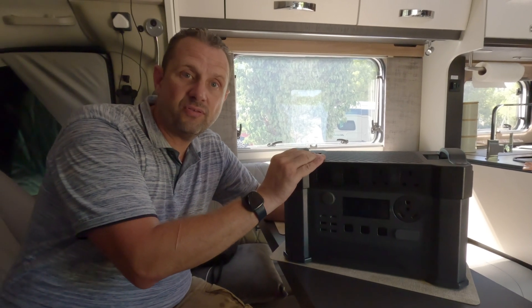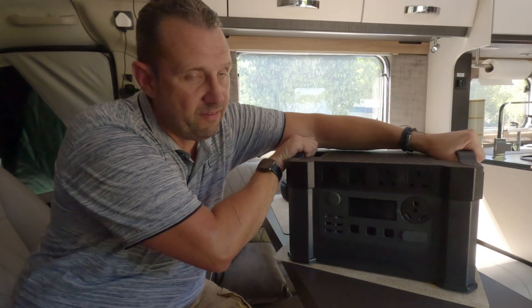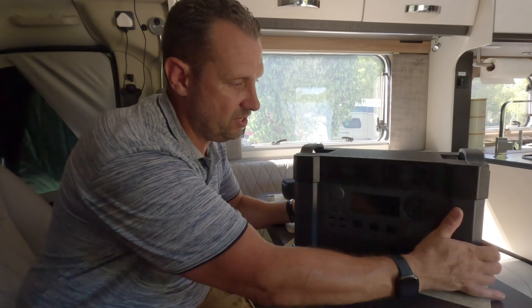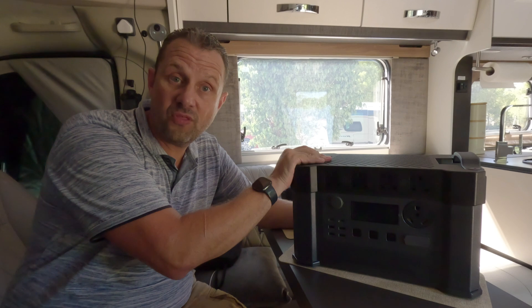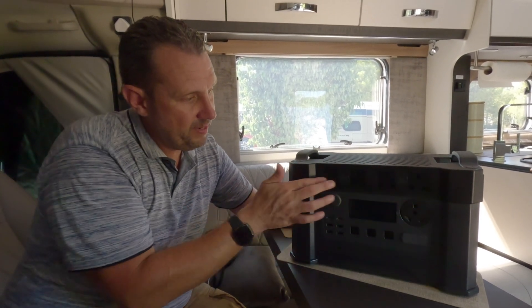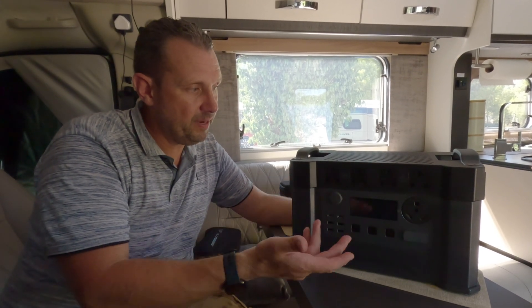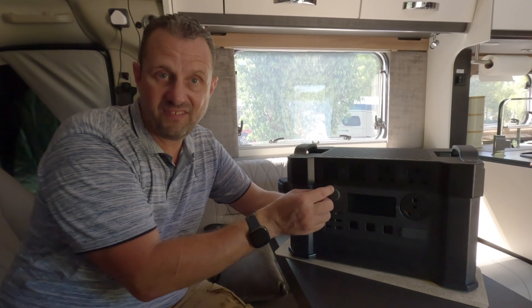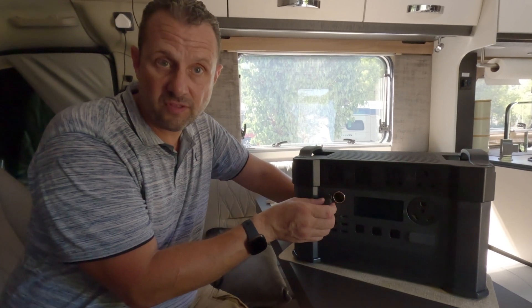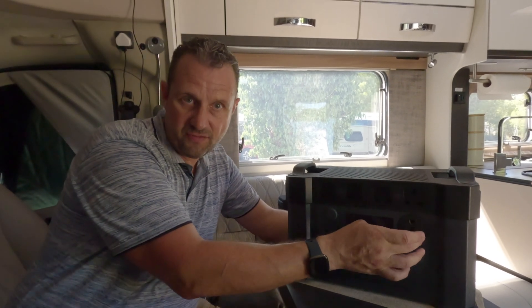On this hot sunny day out here in Spain, the S2000 Pro. It's got nice solid carry handles. Either side has got fans for the AC — the fans are quite efficient at keeping the system and battery cool. It's a lithium-ion battery, 1500 watt-hour, and a 2400 watt power station up to 4000 watt surge. It's got four AC sockets at the top, which can be a little awkward with bigger plugs like an Apple MacBook charger as they can come down over the screen or foul on the 12 volt plug. It has your normal car charger socket so you can charge items that run off the old 12 volt, plus it's got an RV charger — a three-pin RV charger.